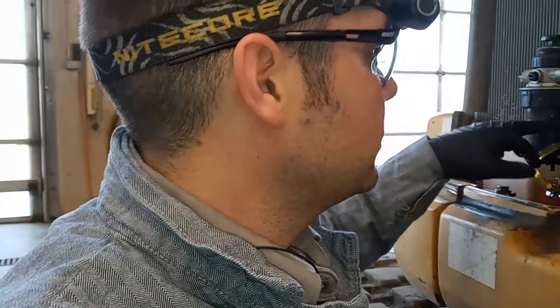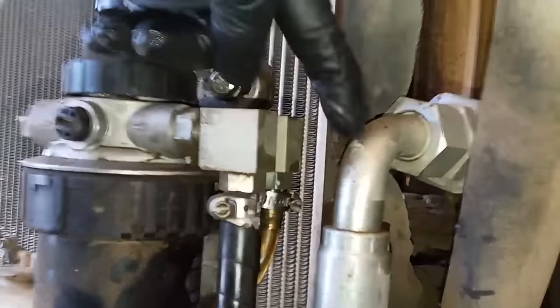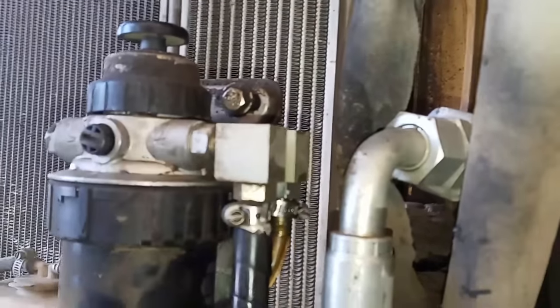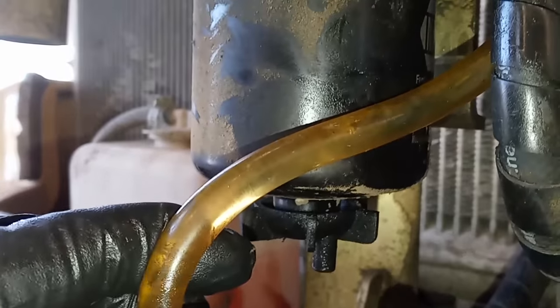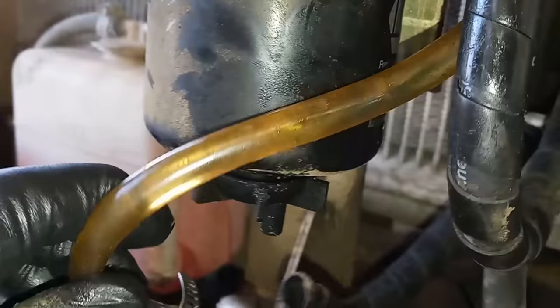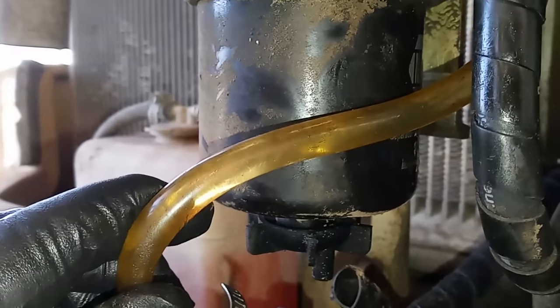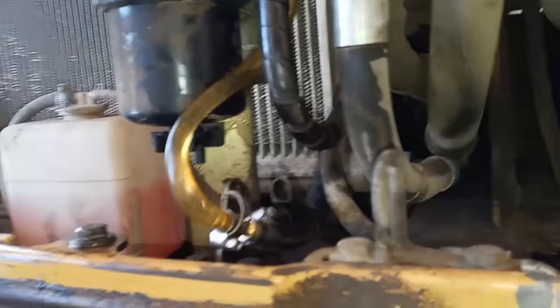So what I did is this — the inlet is narrowed in, which means this is our outlet. It goes through the filter and out. What you don't want is a lot of air bubbles. That's a lot of air bubbles — some are very large. That's a problem, that's too much air, especially for a little engine like this. It doesn't have a huge fuel circuit. You can really see it's sucking a lot of air.